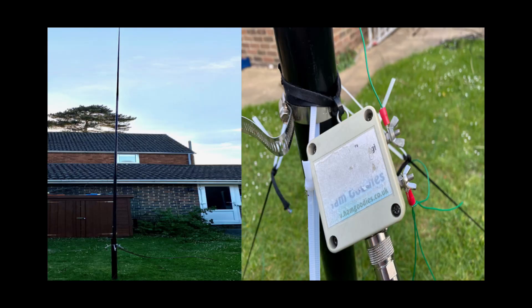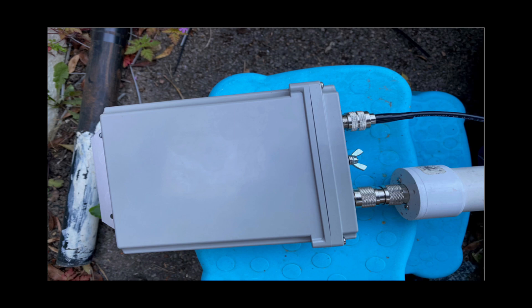That's the basic setup. As you can see here, on the left you've got how it's set up at home — very simple — and on the right you've got the feed point with the 9-to-1 unun; you can see the four radials going off on the lower part, and at the top — the hot side — the vertical element goes up towards the top of the 7-metre fibreglass pole. You can see the tuner at the bottom of the picture, with the line isolator going into the tuner via a double PL-259 connector.